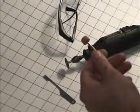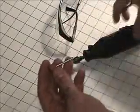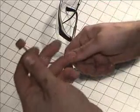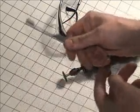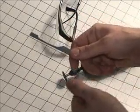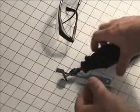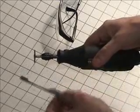An alternate method to producing blanks is to use a grinding wheel on a Dremel tool. This method is a little slower, and you'll find that you will wear down wheels at a fairly fast rate, and it will be fairly expensive. So I'd recommend grinders to start your blanks, and either use the grinder to finish your tip, or use the Dremel tool with a cutoff wheel to finish your blank.